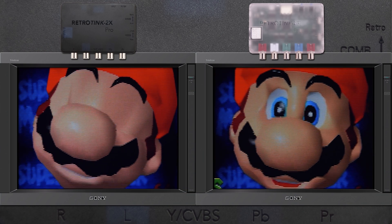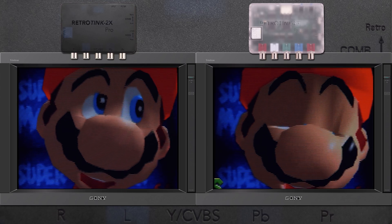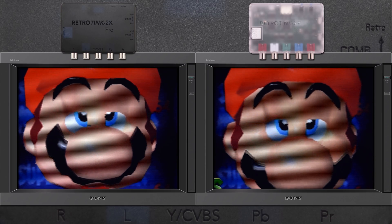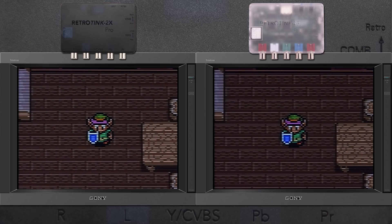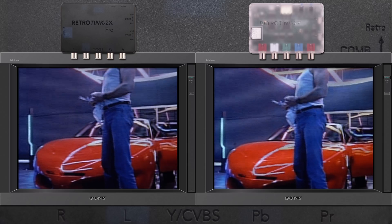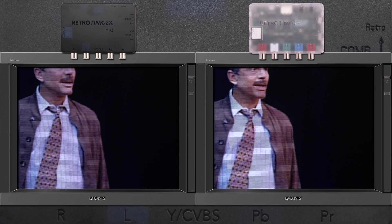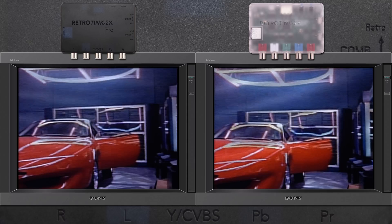While I'm not the biggest fan of artificial scanlines, I wanted to see how they look combined with the bilinear scaling. Overall on my TV, once the scanlines were turned on, the images looked pretty much the same as the original RetroTINK 2X Pro in both 3D and 2D graphics. I think any smoothing that bilinear filtering adds gets cut through by the scanlines, so you wouldn't be able to see a difference. This works out if you mostly use the Tink-M for 3D graphics but occasionally play 2D games — just turn on scanlines and it'll look really close to the original Tink. Sometimes I like watching old TV shows shot in 480i with the RetroTINK's scanlines on; the effect does make me feel like I'm watching on a CRT. At least you have a pretty cool scanline filter if this is your thing.